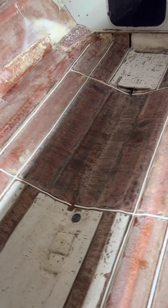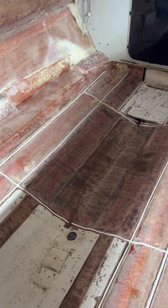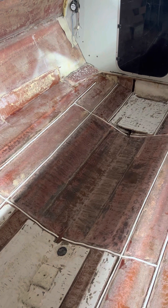What you see right there — all that white — is a foam tape. I've done boats both ways. This is a 20-foot boat, a Maxim SC 2000. There are mixed reviews: some people literally just slather fiberglass resin in, set the stringer down on top so it pushes out, and then create a nice edge so it's not a 90-degree edge anymore — you create almost a concave type design on each outside of the stringers, so when you lay your fiberglass mat it's creating more of a 45-degree angle rather than a 90.